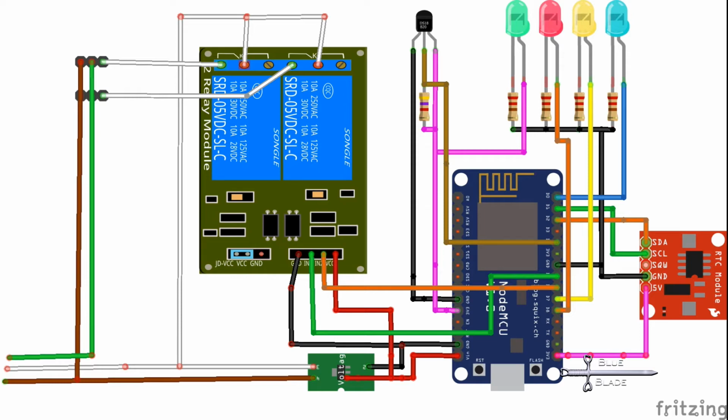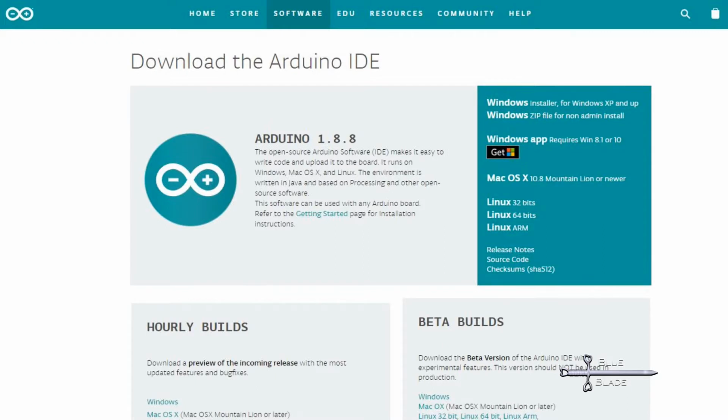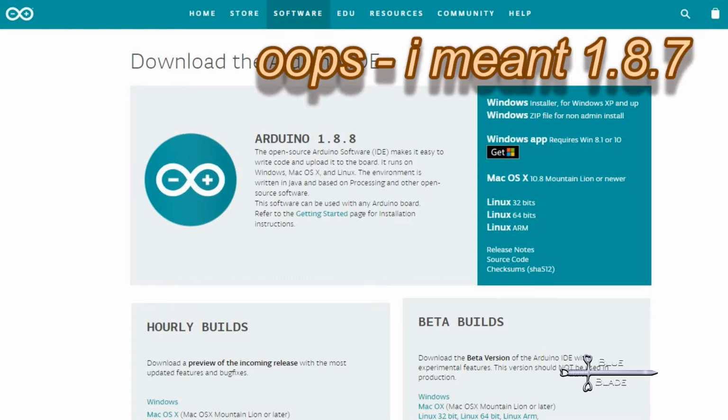To begin programming, we have to connect our low-cost NodeMCU ESP8266 board with the Arduino to program it. The cloud-based Arduino Create site does not support this board, but the desktop client does, with some modification. So, if you haven't already, download and install the latest Arduino software. I'm using version 1.8.2 here.